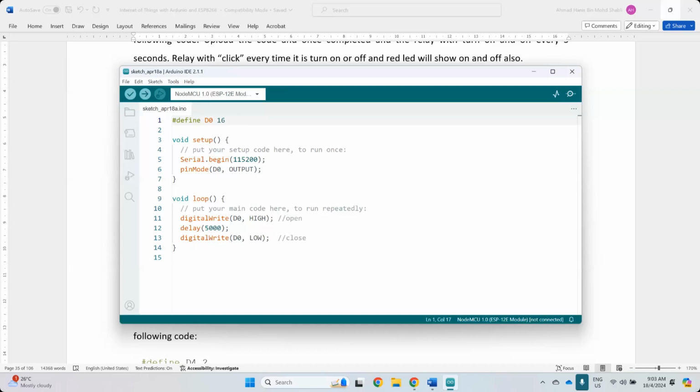Okay. And then you can just total up. Oops, my microcontroller can only support up to 200 milliampere, but this one already draws 300 milliampere, which is beyond the capability of the microcontroller. So you might need to consider running this on an external power supply instead of depending on the power coming from here. So the specification is very, very important for you to read first.